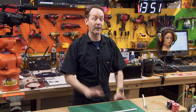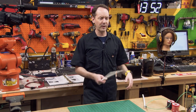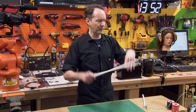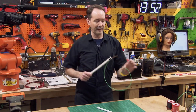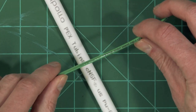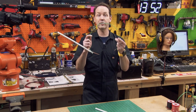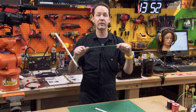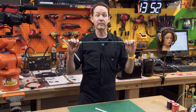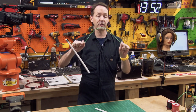To that, you need a wire. This is fungible but it does matter long-term. If you're just throwing together a quick thing to safe out a bunch of capacitors for storage, use whatever you find. But this wire here is THHN — common standard stranded house wire. This is 12 gauge THHN stranded, which is fine. It's good for 20 amps in a conduit all day long for 20 years.